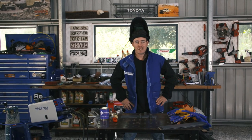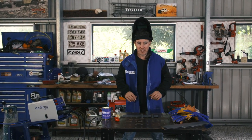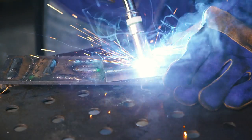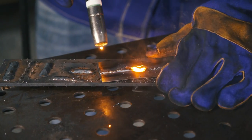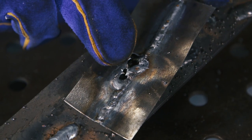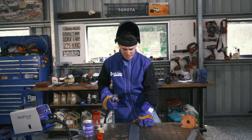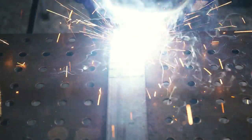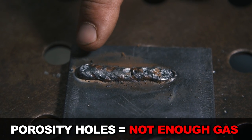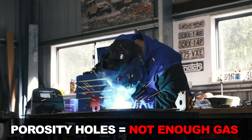There are a few of the basics that will pretty much get you started with welding. Next we want to go through some of the problems you might encounter — whether it's impurities, incorrect surface preparation, or wrong welder settings. We're going to troubleshoot them and show you how to fix them. The first weld I'm going to show you is without gas — I've turned the gas off so you can see what happens. You can see there are porosity holes, which are usually a sign of not enough gas. Turn up your flow or check you've got enough gas.